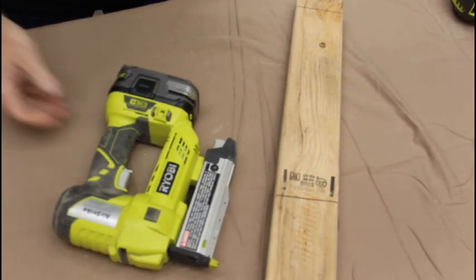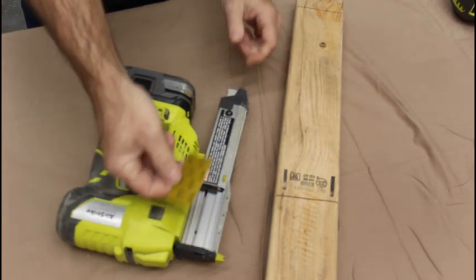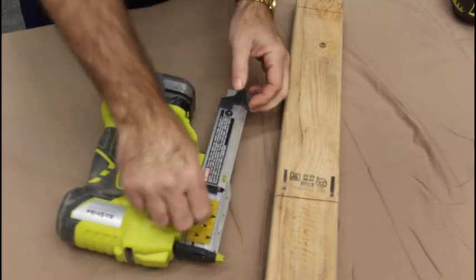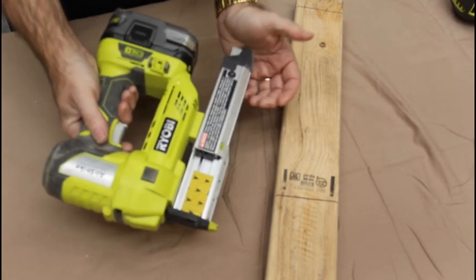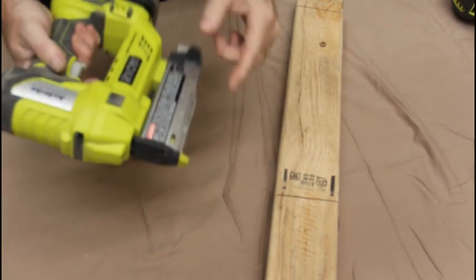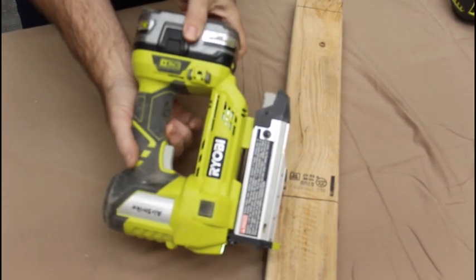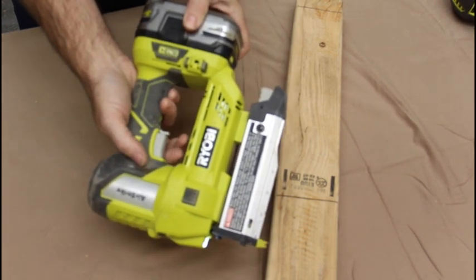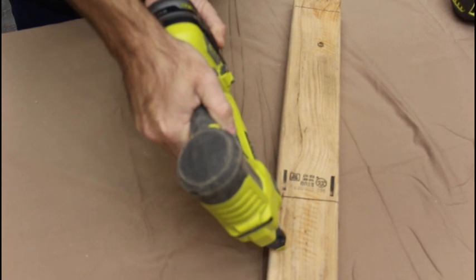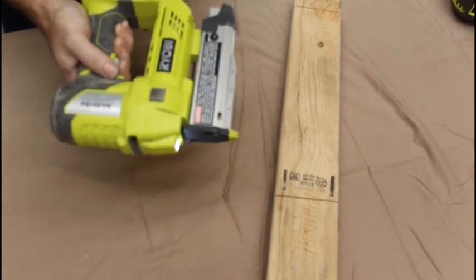The P318 is very similar to the P320 in the way it loads — you just squeeze the thumb button on the back, pull it back, and then put the pin nails in. Pin nails are headless, so they put arrows on them so you know which end is the driving end or the chiseled end. This one you have to release it with screws if you need to clear a jam, and it is not touch-sensitive for loading. There's a safety switch on the back of the trigger that you have to depress before you can shoot — if I don't depress it, nothing happens, but if I do, I can shoot. Be careful: if this safety is depressed, this will shoot even if it's not pressed against something.